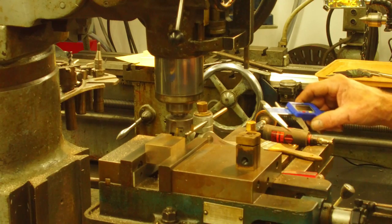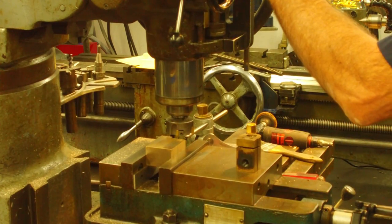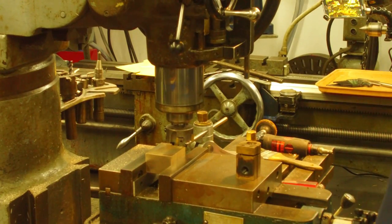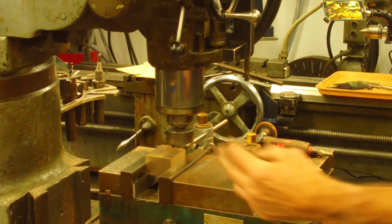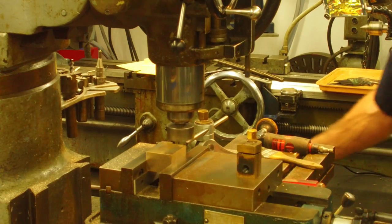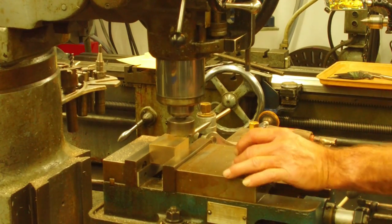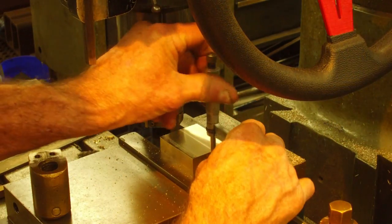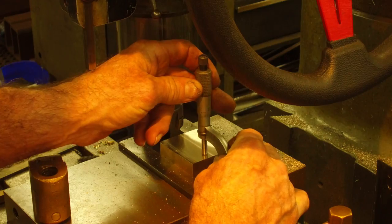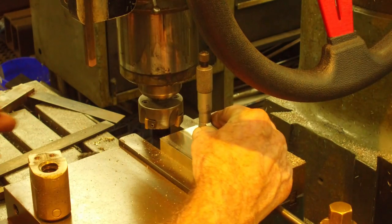Dress it off, flipped it over, and it's like 1.317 right now. So we set our dial here at zero, and we'll go ahead and we'll take 25 off of here. And then we're going to get our micrometers, because we're going to measure it while it's in on the parallels. Before we bring our cutter back to start position, we could cut in both directions, but we like our chips and debris to fall off the backside there instead of coming out towards us.